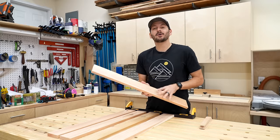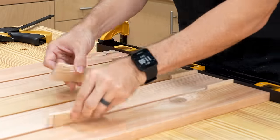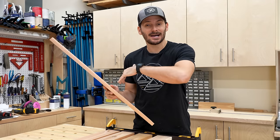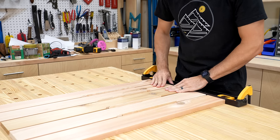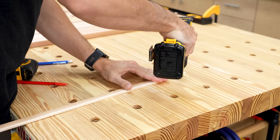The last pieces of the shape are the back, and I'm gonna have 5 boards per back, and there's gonna be a 1/4-inch spacer in between each of them. Now I wanna have the nice traditional arch top on there, because I do like that look of the Adirondack chair. And I have a straight edge down here, so I'm gonna clamp it down and line everything and then draw my arc on the top.